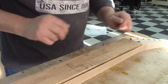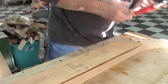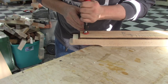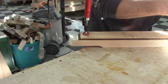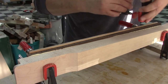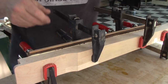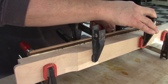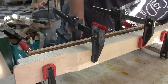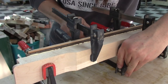I've got a piece of scrap plywood and now I'm fixing to clamp it. I don't want to go wrenching on this right away when I clamp it, because remember it's the sixteenth-inch plastic — it's possible that stuff can wiggle around if you really crank on it. So let's get it close to set up and clamped in a few spots, and then we can go herking on it. Now if you're really smart, you can do two necks at once — which is what I normally do — and just clamp them together. You can also do this with a pre-radiused board.